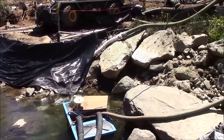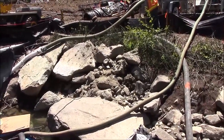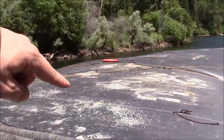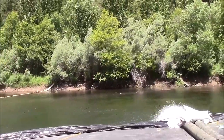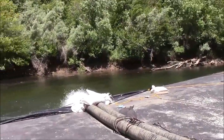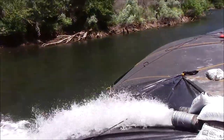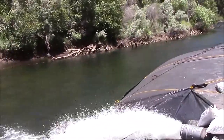their work area is dewatered, but they don't want to pump so much because they get charged for how much they pump. So now the plan is to deploy a sheet of material all along this AquaDam from the top of it, 30 feet down the side of it, to 30 feet out into the water. Hopefully, as this sheet sits down against the stream bed, we should be able to stop up some of the water that's coming in through the broken stream bed with that sheet.